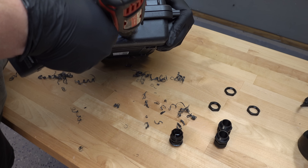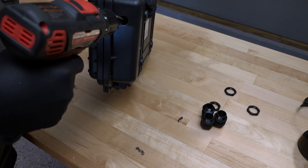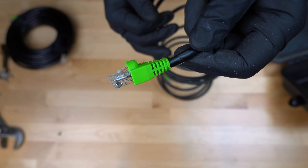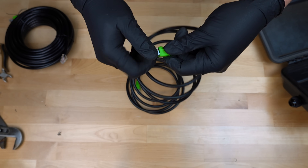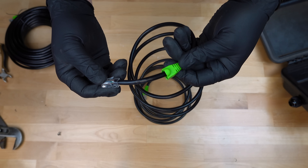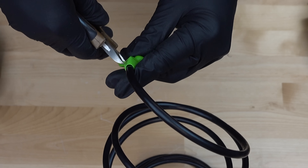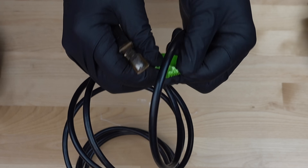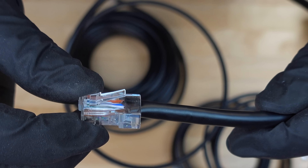These glands give you a rigid pass-through but they've got a gasket inside. Once you get the holes the size you want, you'll need to feed the cables in. These strain reliefs are just too big, and if you try to leave them in place on the camera connections, they're going to mess up your seal and it will not be waterproof. Some brands of cables, you can't remove the strain reliefs, and I've had to cut them off with a razor blade, which is not fun because if you slip, you can damage the cable. In this case, I'll just use my cutters to get them out of the way, and now I've got a standard RJ45.